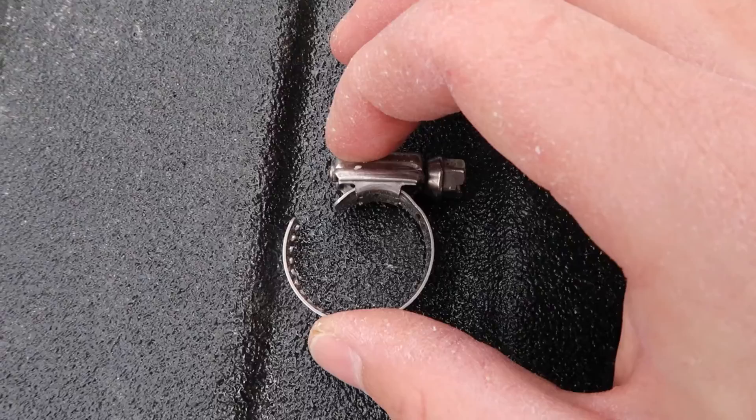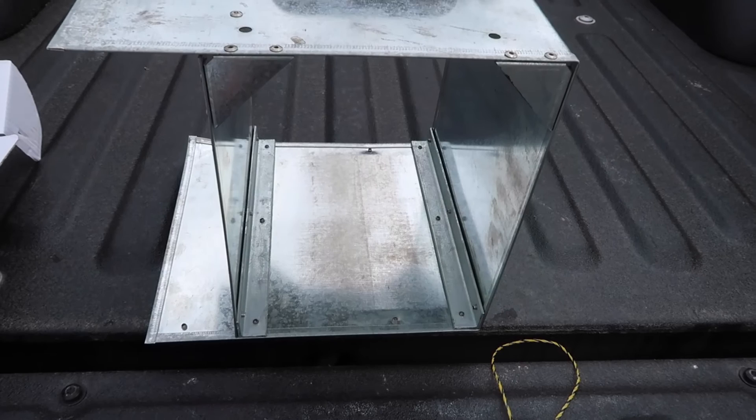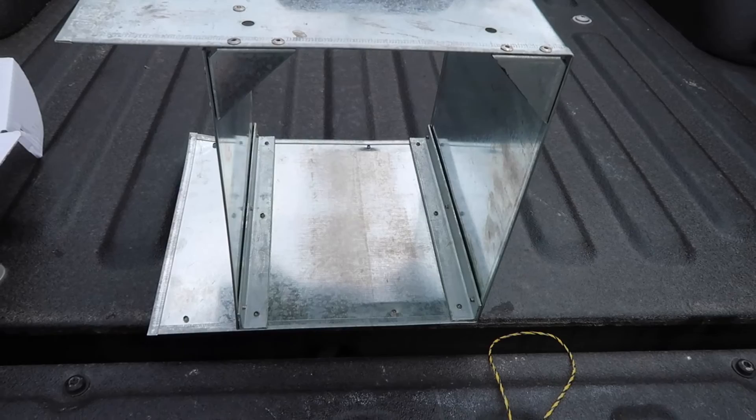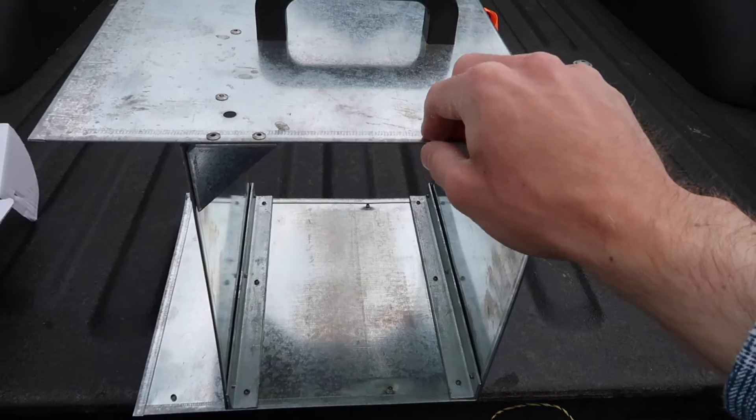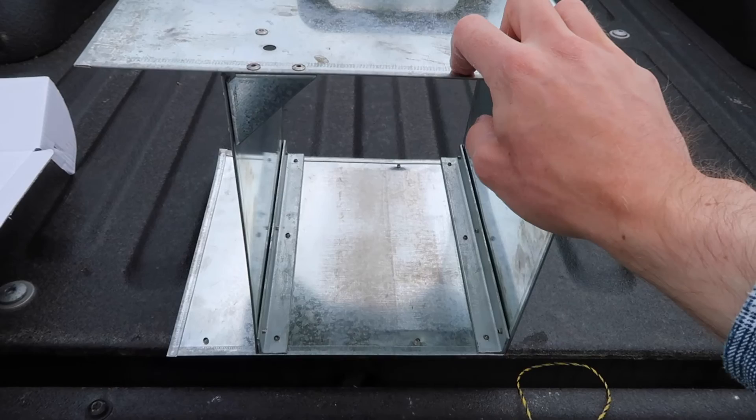Lastly, I bought this to house the energizer and the battery. The energizer is not supposed to be directly exposed to rain, and it's also not supposed to lay horizontal — it needs to be upright, vertical. So I bought this; it did come with a couple screws, which are now, of course, missing in the garage somewhere. This is really designed to mount solar panels too, but I'm going to try to also use it for my purposes. So there it is — this is what I'm using to get this done.